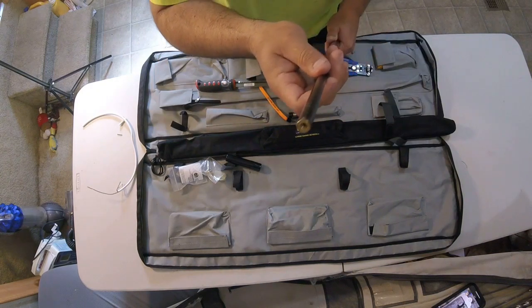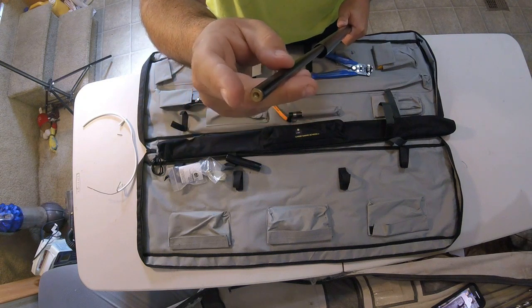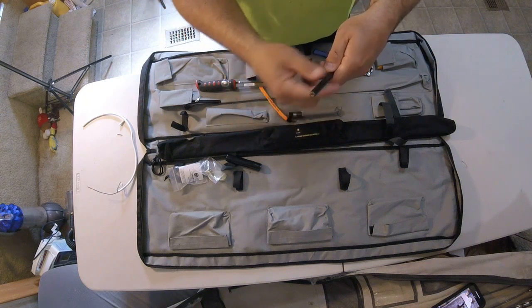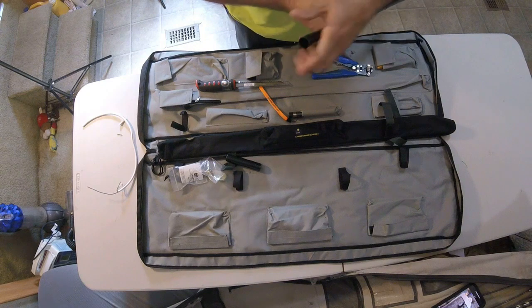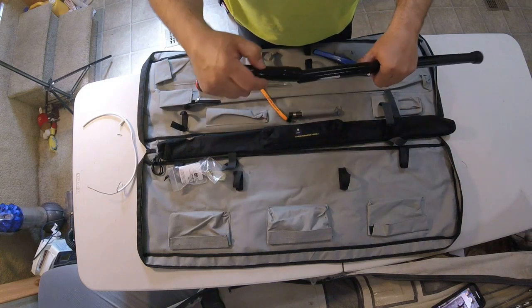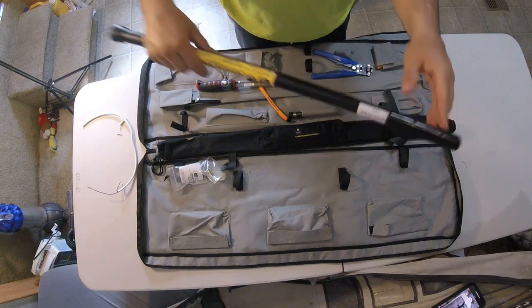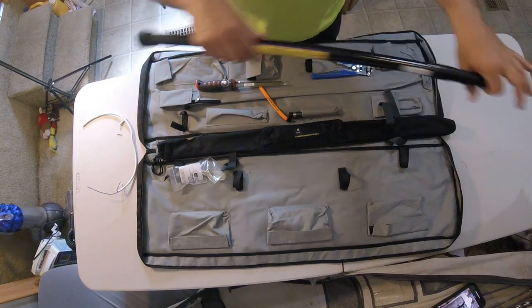And as you can see, it's threaded on the end, so you can use Labor Savings Devices tools. You just thread them into the end right there. You can put the Z hook on here, the J hook on here, all those different custom tools. You're in your attic and you've got the wire that's way in the corner and you can't reach it. That's really where this is handy. Or if you're doing a tile grid ceiling at a school or hospital, and you've got to reach way across tiles, boom, you stick that up in the ceiling, extend it out, put the hook on the end, grab the string, grab the wire, and pull it.